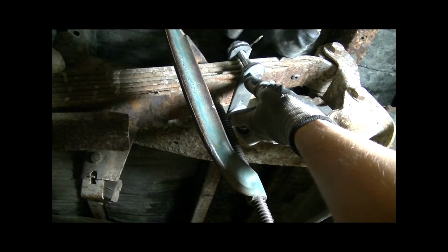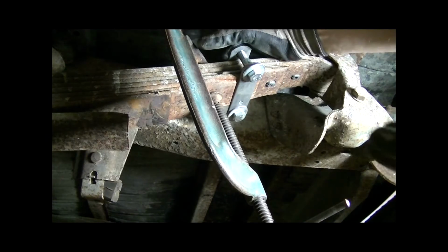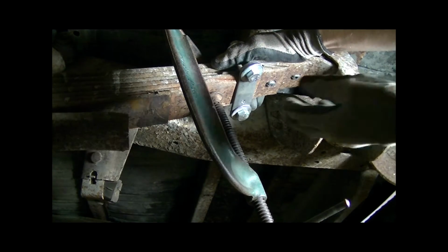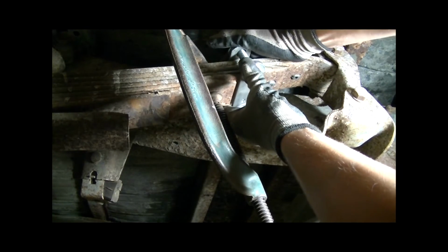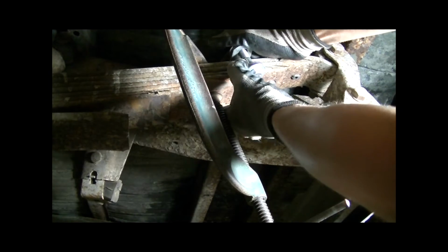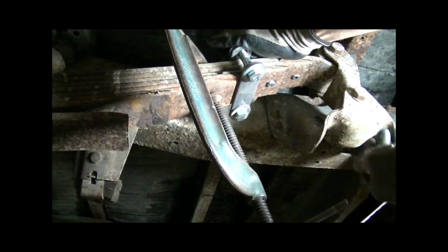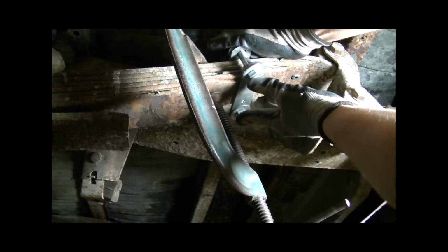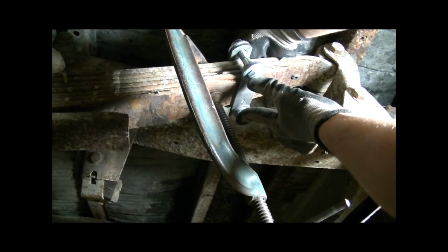Now, this next step really depends upon what your leaf pack actually looks like. In this case, I've only got a little bit of room to work. So I'm going to move this bracket till it's a little over 1/4 inch away from the end of this particular leaf, and line that up so there's just this little bit of overhang. Apply the pressure at the base, and then just snug up the nuts on the top.